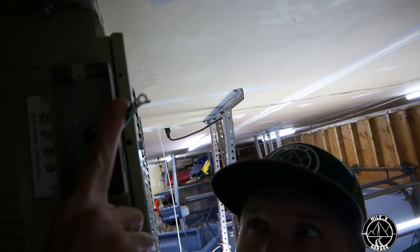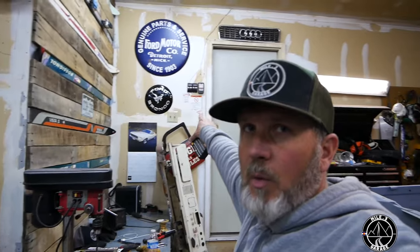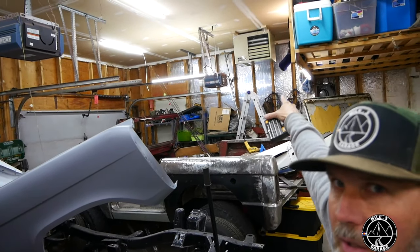These breakers are rarely used except for going up and down, and in the winter I'm probably not going to open the doors at all, so I think this circuit will be fine. You've got three wires — your standard green, black, and white — and you're just going to wire those into a standard appliance cord with the same ends. I'm going to wire that up and put some wire nuts on it. Then on to wiring the thermostat — I went ahead and ordered the Mr. Heater thermostat with the unit. It was about 30 bucks for an analog thermostat with a 35-to-75-degree range.